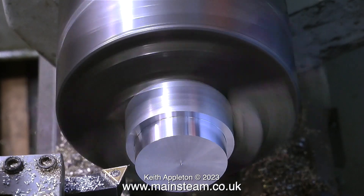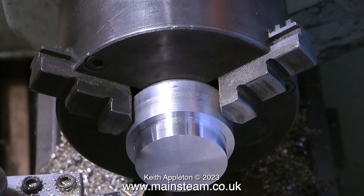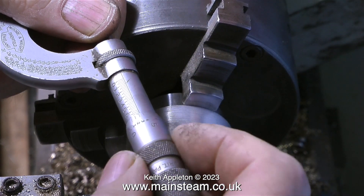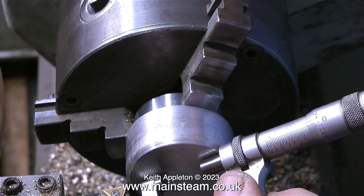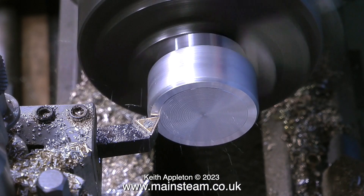Time to sit back and watch me make an aluminium pulley. This is the smallest piece of aluminium I had in the workshop — it's a little bit big and I'm having to turn quite a lot of it down. The finished diameter of the pulley where the drive belt is going to fit needs to be three-quarters of an inch in diameter. I'm setting that on the micrometer to get an idea of how much metal I need to remove.